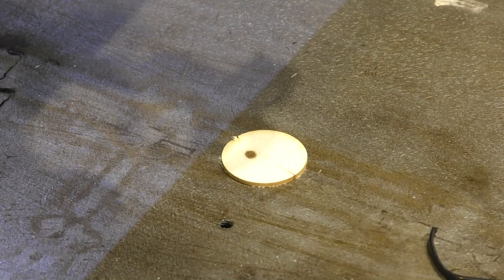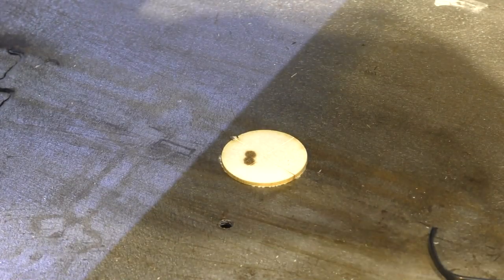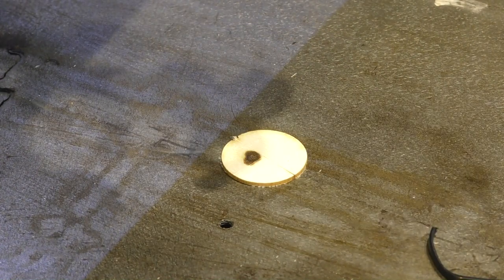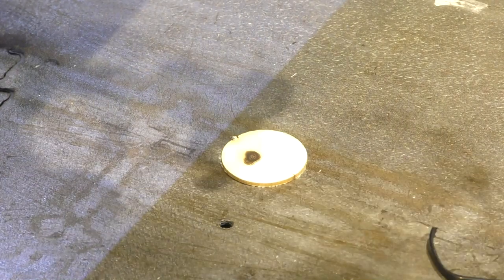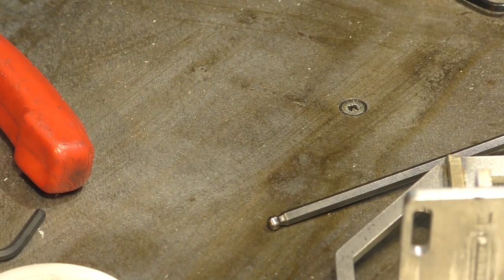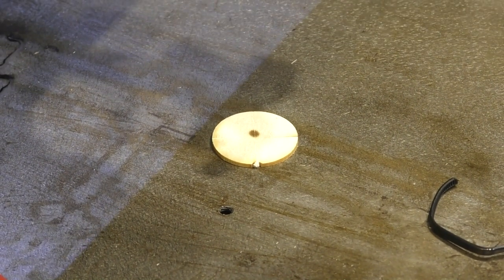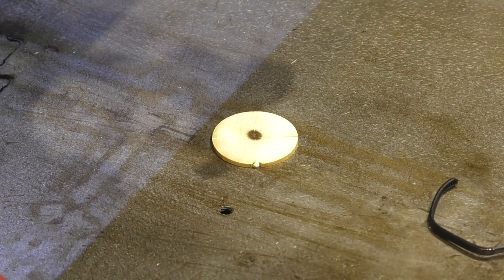Now I'll drop my table down by at least 100mm and do another pulse. It's not in line as you can see, so I've got to bring the beam back. Let's try again - not bad, a little bit more, pretty good. And then I've got to go across very slightly to the back of the machine - I'll wind that one out just a shade. Too much. So now I've got it nearly there, I'll do the same thing again and repeat it a second time. Just a little tiny bit backwards - and I think that's pretty close.